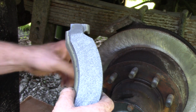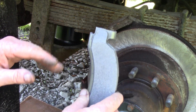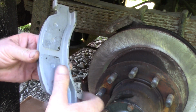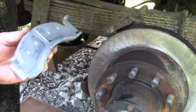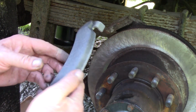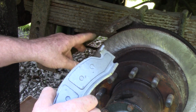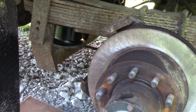If you got some roughness on there, this little cross hatching, you just touch the brake, it's going to stop. The pads aren't going to get near as hot, they'll get broken in more properly, and so therefore you don't need a bunch of goo on here. In rare instances, there's reasons you should have. These I'm not, and these brakes will not squeak. Even these cheap pads, you can see all the metal in them, they're not going to squeak because you're going to get it broken in properly. I live by it all the time. I don't have brake squeaks come back at work like the other guys.